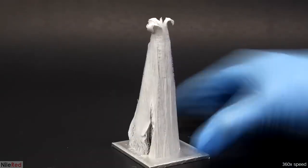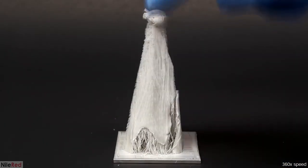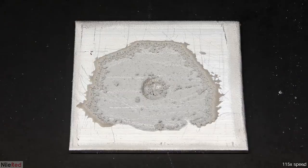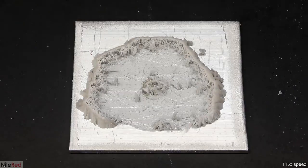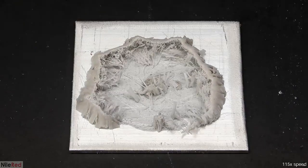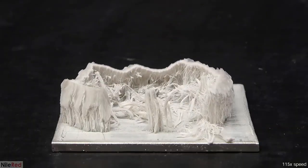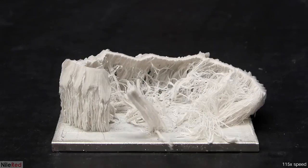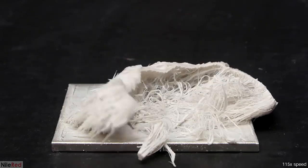This releases the mercury from the amalgam, which can then go on to combine with more aluminum and continue the cycle. Even if all the visible mercury is cleaned up, some of it has seeped into the aluminum and it can continue to destroy it. This is the reason why you're completely banned from taking any amount of mercury onto an airplane.